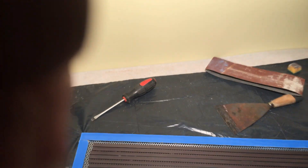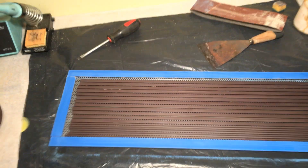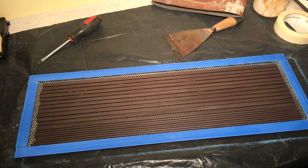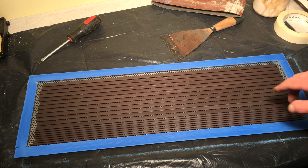You can see that some spaces between the magnets look wider, but it's not actually the spacing — it's just that one magnet blocks off most of the hole. So in between these magnets the open area is less than 32.6%. Only the perfect ones maybe hit 32.6%. So open area is even lower than it already is. I reckon it's like half the open area compared to the Magnepan — which is not what I wanted, but it is what it is. Next video will probably be Mylar.